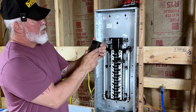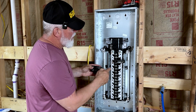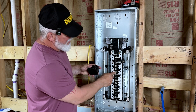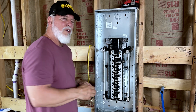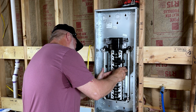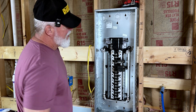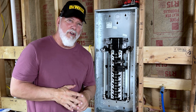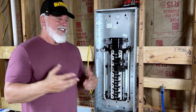The other type is a double pole, rated at 30 amps. It has two spades — one on this side and one barely sticking out here — so it pulls from both sides, meaning you get 120 plus 120, which gives you 240 volts. When I put this one in place, I'm pulling from both locations. 240 volts is what powers your dryer, your stove, things like that.